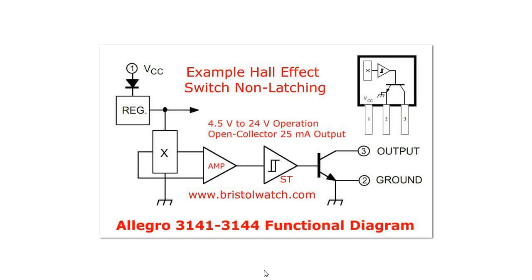We've seen how to take a ratiometric Hall sensor, add a Schmitt trigger type circuit, calculate the operate and release points, and get an open collector output through the comparator — building a Hall switch. Most Hall sensors out there tend to be latches, which are somewhat different from switches, and it all changes in the Schmitt trigger. That will be the subject of the next video: how to build a Hall effect latch. Thanks for listening — please hit a thumbs up, and visit my website at www.bristolwatch.com. The link to this material is in the description.